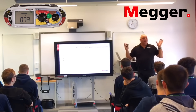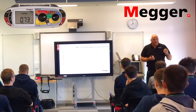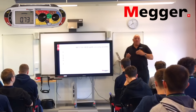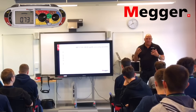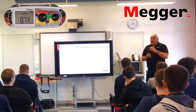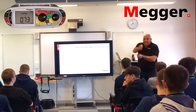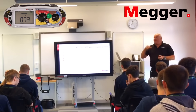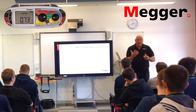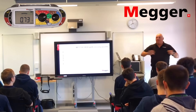It's almost an industry standard from what contractors tell us at events: depending on the amount of testing you do, you want to be looking at changing your leads every eight to twelve months, regardless of condition. Always carry a spare set. The weakest part of any test instrument is the test leads — the connector is a spring, and if you take it in and out repeatedly, it starts to get weak and will affect your test results. So if you start getting funny readings, put new leads in. You don't need to keep zeroing out — put your new leads in, zero them out once, and that's it.